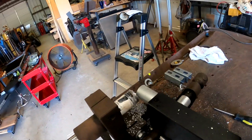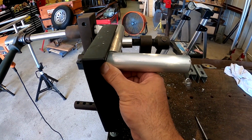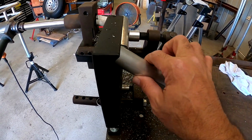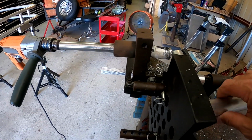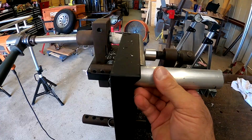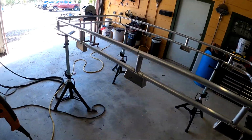And then to make sure that your saddles line up, I put another piece like this and look at it. And I make sure it's square, so that way it's in the same plane. Because if you make this saddle and then you don't do that, and you make the other saddle, then when you go to put it in the pipe, of course it's not going to work. So instead of eyeballing it totally, I just put another piece of pipe in there, and it gets it pretty close without putting a level on it and everything. So I just thought I'd share that, but it's coming together.